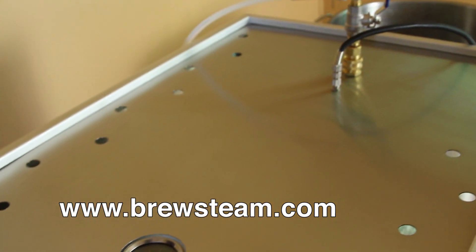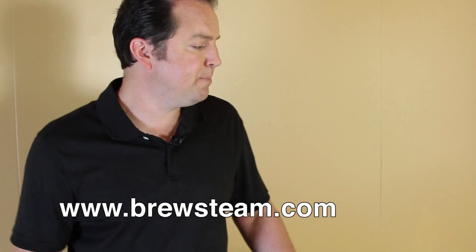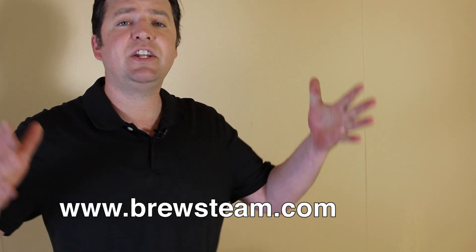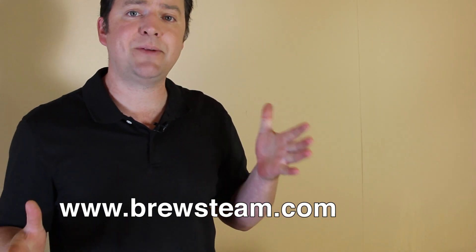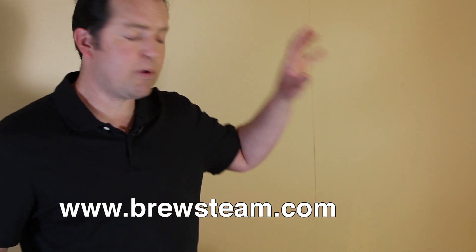What's nice about this system is you have full control. If I want to go to 209.5, we're holding within a half a degree. Unlike any electric system, steam has no ability of scorching. You'll have no caramelization of your sugars — it's extremely gentle. It's the gentlest way of actually introducing the heat into a pot. And instead of heating from the outside in like a traditional steam jacket, we're heating from the inside out. What that does is it gives you a very high degree of efficiency — we're pushing 98% efficiency. There's almost no loss between the hose and the pot, so your steam is directly affecting the actual liquid in the pot.